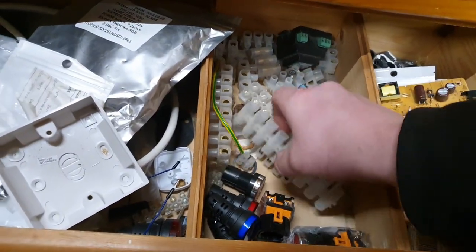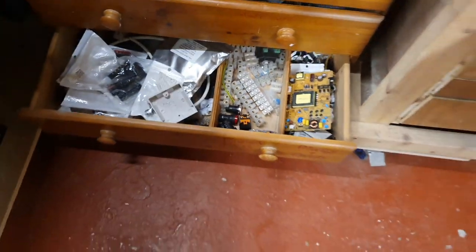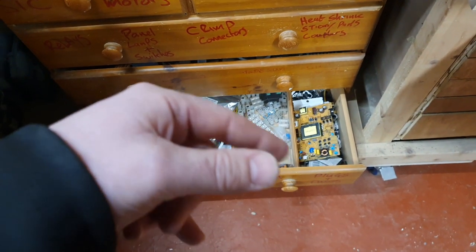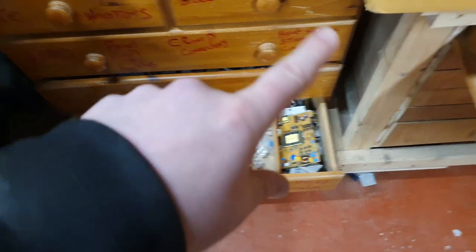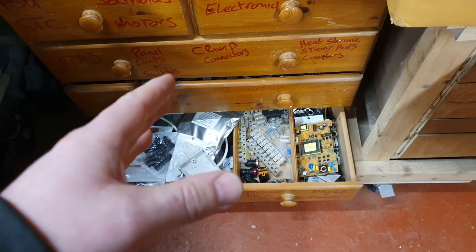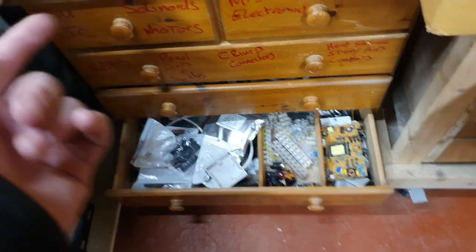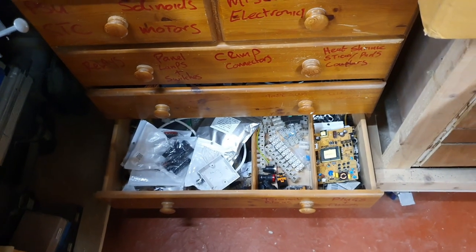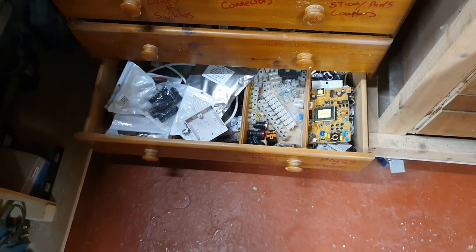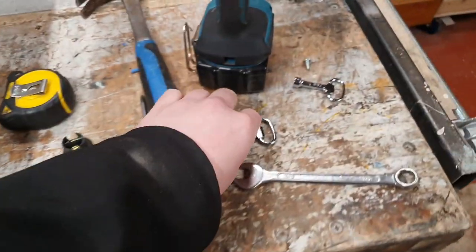And then I've got all sorts of stuff shooting out of the side of it, such as my pumps. They're all powered in there. So of course we've got these sensitive electrical signals coming from the PT100s and what have you. And then we've got power cables coming out of the panel, which are carrying 240 to pump motors, which are inductive loads, and of course those inductive loads cause feedback on the cables and make a bit of a mess of the signal. So I think we'll just do it all in this new box, separate everything, lay it all out nicely.